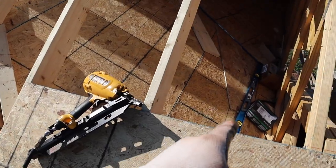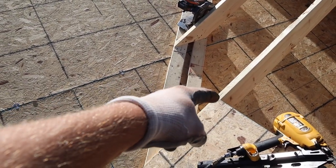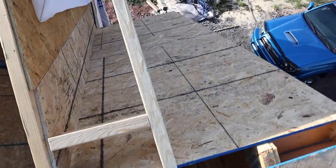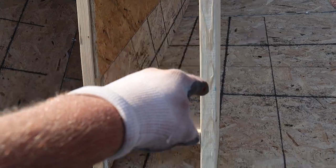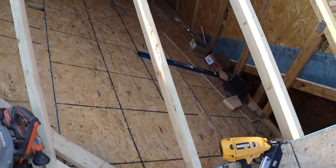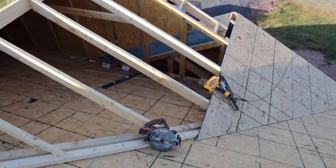It's pretty simple — keep your straight line going with the top of the plywood, make a mark on the edge, then measure between here and there and from here to here. That's going to be that square section, and it's going to look like a speed square when it's cut. We got that little piece in and it looks really good. I went ahead and did this little offset section — it's only a three-foot roof right here, and I also had to splice this because it was short. That open gap is for ridge vent by the way. We pull from this side now and it takes us over here — then we do the same process we did on the bottom sheets. It's still windy but I've got to get my viewers their content, so let's finish this up.